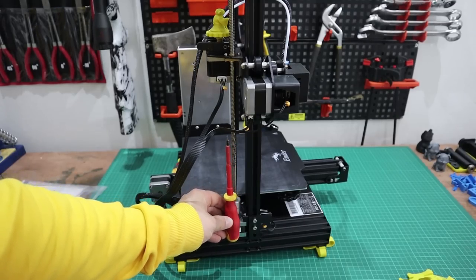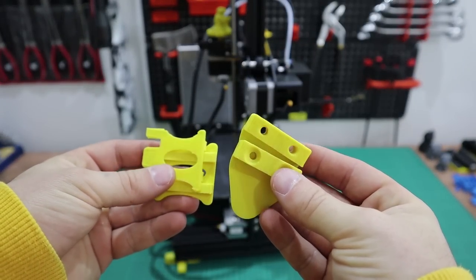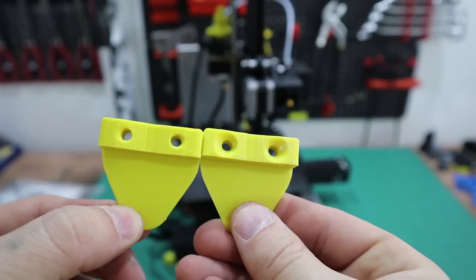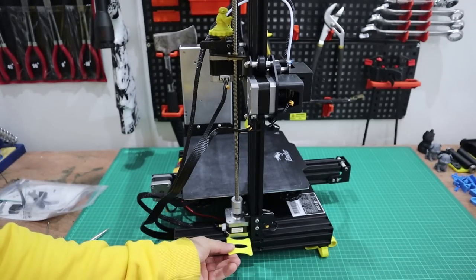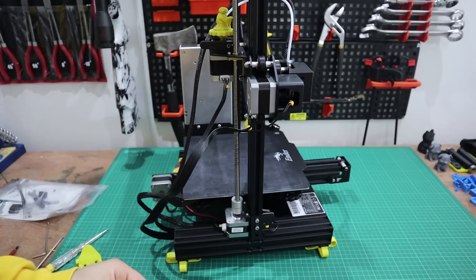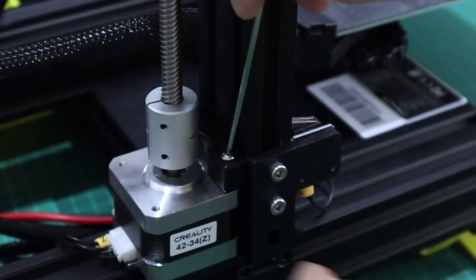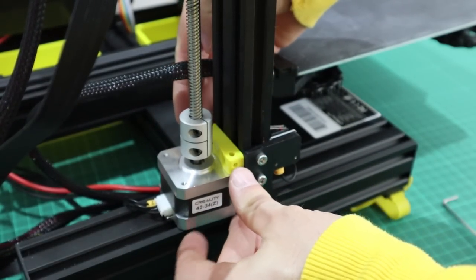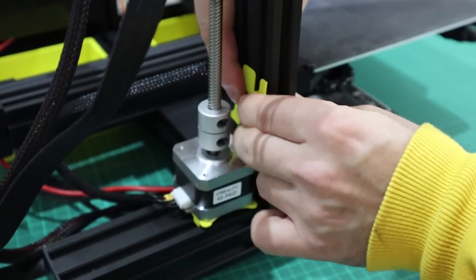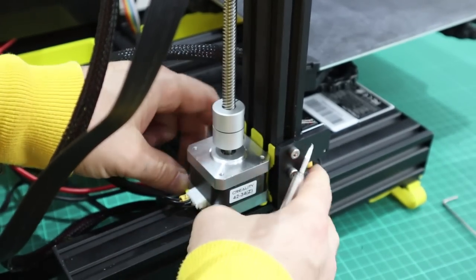These are two different types of spacers you can use on the stepper motor for the z-axis. They're almost identical apart from the one on the right having chamfered holes for different types of screws. The ones I prefer are two pieces: one goes underneath to lift the stepper motor up, and the other goes behind it to pack it out a bit. Just undo the two stepper motor screws and the other two on the black piece. The second type I prefer — one piece slides under, one piece slides behind. It can be a little stiff so use a screwdriver to push it down, then reattach the screws. Before tightening all the screws, make sure the gantry goes up and down freely.